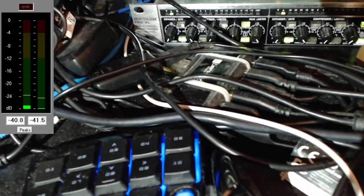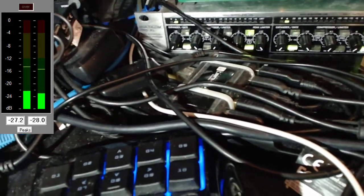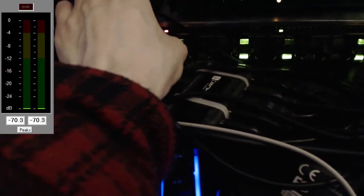So if I want, I'm going to turn up one of those noise gates until the little green light on that top left corner goes red. And now we're down at negative 70, which is pretty good. The other thing is that I don't just stop when it turns red. I give it another couple clicks just to make sure it really seals off that sound leak.